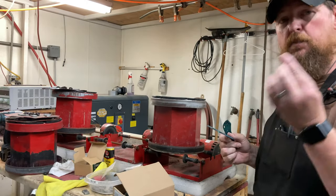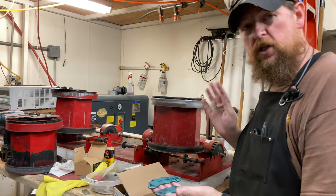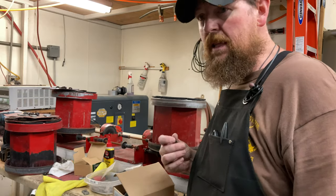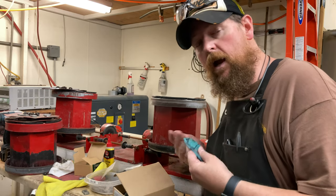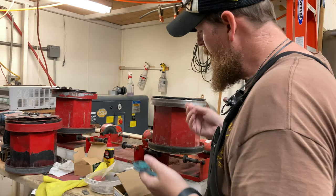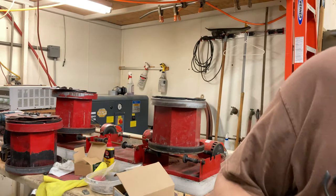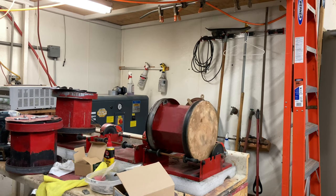The next step is to put these parts into tumble. I'm going to blast these parts and start fresh — they'll have a really nice finish on the titanium. I'm probably going to tumble them overnight, so this may be the end of this video. I'm going to stay here for a few hours and check on it. If it's progressing quickly I might be able to finish it today, otherwise we'll pick this up tomorrow around noon. All the parts are in to tumble. I've got a leak in that tumbler — I'll need to take it apart and check the lid and gasket.